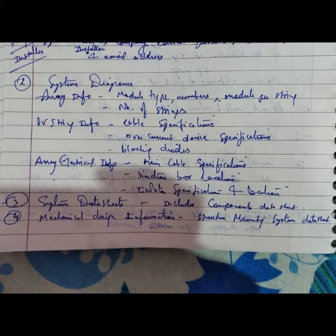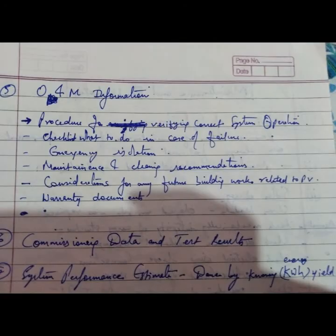System data sheets include component data sheets and mechanical design information, including structure mounting system data sheets. O&M information includes procedures for verifying correct system operation, a checklist, what to do in case of failure, emergency isolation, maintenance and cleaning recommendations, and considerations for any future building work related to the PV system.